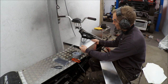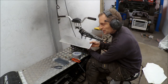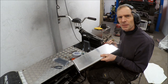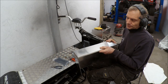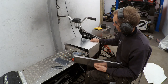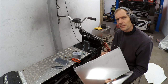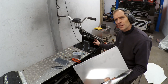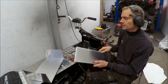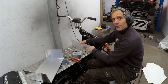Now I am trying to build a box around the batteries. I don't know how to measure this one — it does not fit. I must have something wrong with my measurements. The idea is to make this fit using a flange here. I will rivet an aluminum sheet on the bottom so it fits in the flange, and then I will put some rubber to seal it.